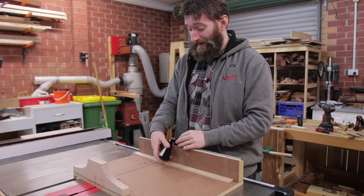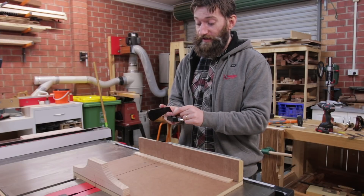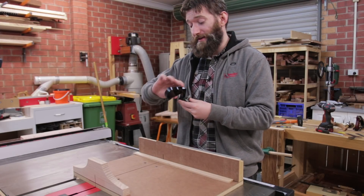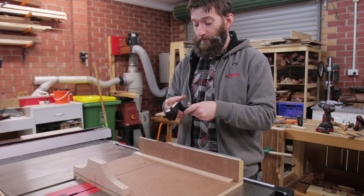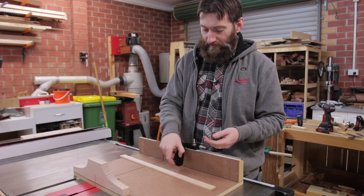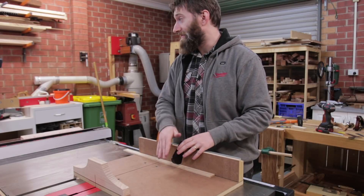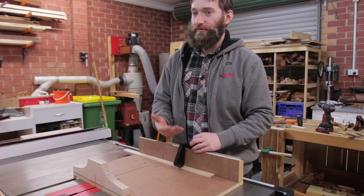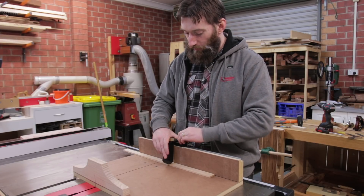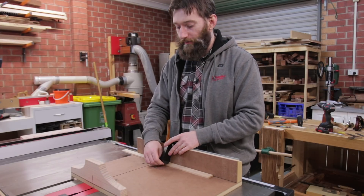Countersinking all the holes and deburring all the edges was necessary as HDPE can be really sharp. You might have noticed a small design change — I added a little bumper the same width as the nylon washer I'm using. For hardware we've got a 5/16 inch T-bolt and screw, then an M8 bolt, washers, and a lock nut holding it all together. The lock nut is nice because I can adjust how much tension it requires to move the flip stop. One interesting design outcome — not how I planned it but it worked out well — is the general shape of the arm. I realised it actually makes a really good clamp for small pieces. I can hold the flip stop down to hold the piece in place rather than using a pencil with an eraser on it and hoping for the best.